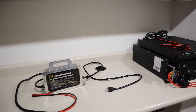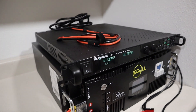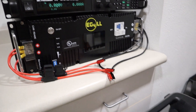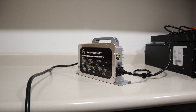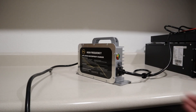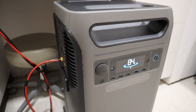In the final section of the video, we'll be testing a few alternate charging options for the F3800. I have a 48 volt LFP battery AC wall charger, a high powered BK Precision DC power supply, and I'll also do demos with the EG4 48 volt server rack battery — all plugged into the XT60 ports so we can leave the 240 volt output enabled. In the first test, I have the 48 volt battery charger connected up to the F3800 XT60 port. You can see a red and green flashing alarm — it's not recognizing the battery voltage. The screen shows it's not charging with no watts going in. Unfortunately, it will not charge because it doesn't have a battery voltage that it can work with.